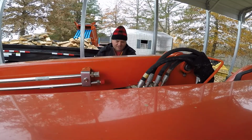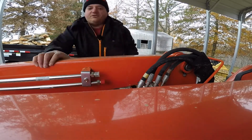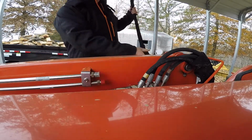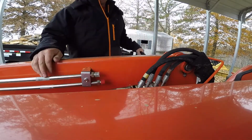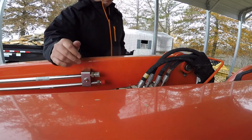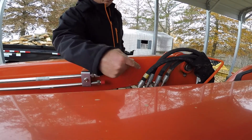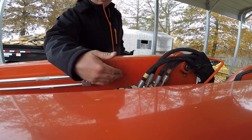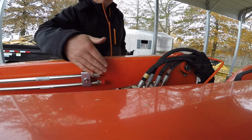So our next step is to hook up our line from our metal tube down to our quick connect. One end of it has a quick connect end. The other end has the thread on end to match up to our solid tube up here. Now the thing is too, we're still trying to match up, from our solenoid down here, we had line 1, and we had line 1 from the output on the solenoid to the input on our quick connect. So we've also got the side or line 1 on our quick connect to run up here so that they match up.